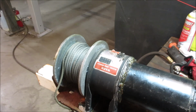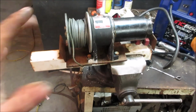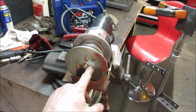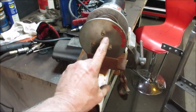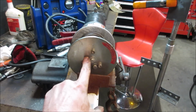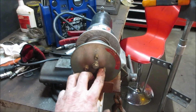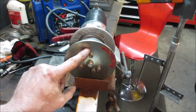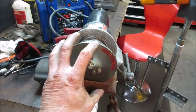Let's explain it like how much cable you're putting in. So the winch has a certain RPM it runs at. Say it's running at 60 RPMs. It spins 60 times around for every minute. Well, if you're spinning wire up here on the inside, that 60 revolutions, say, pulls 12 feet. You're out here, it's pulling 30 feet of cable because it's that much further wrapped around it. There's much more cable the further you get out.